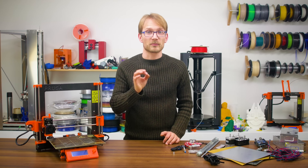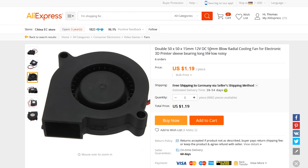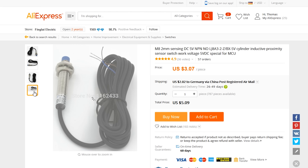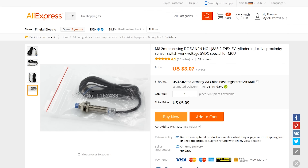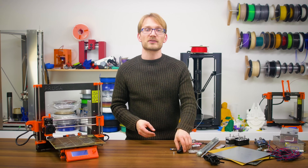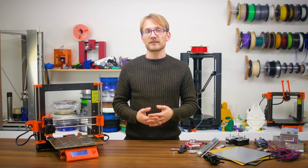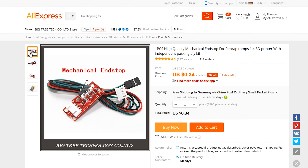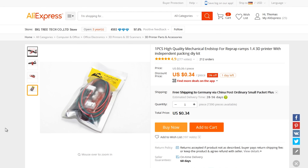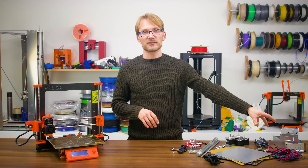The smaller electrical parts for the build are a 50x15mm radial fan for powered cooling — I picked a low-noise type — an inductive sensor to use as a z-axis probe. You can get a type very similar to the one Prusa uses, running directly off of 5V and making any sort of voltage adjustment circuitry completely unnecessary. You will also need end-stops; the easiest option is going with complete sets with the switch, a connector, and some smoothing circuitry on a PCB at around 70 cents for a pair, which also includes a cable.